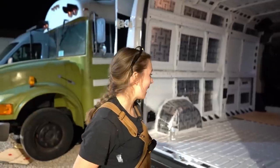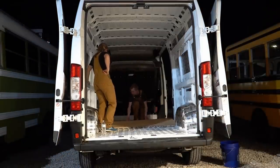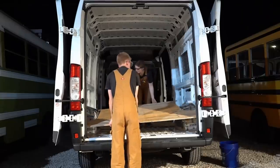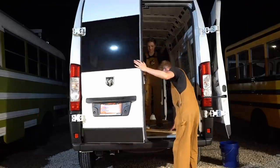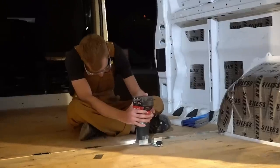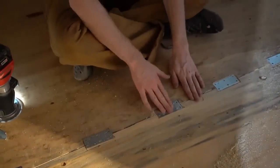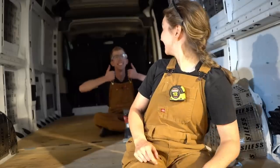This is probably way too soon to say this, but I am pleasantly surprised at how quickly we were able to do that. I think it took us several weeks before we were putting in the subfloor in the bus, so to have some subfloor down on day one is great. We're trying out a solution where we're routing out space in several sections of the plywood so we can inset the metal brackets and screw the separate pieces together. We just did the first one and I think it's going to work as intended — it's working!